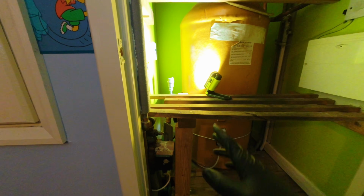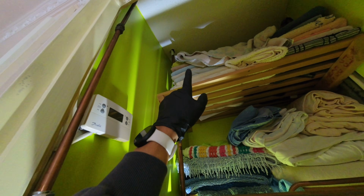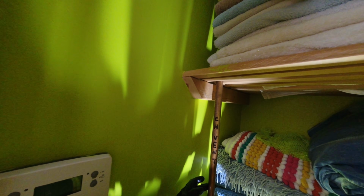Right, I've been up in the loft and I've bunged the F&E tank. I would have taken the camera up there, but it's quite tight up there where the F&E tank is. What's strange though, obviously the vent pipe here is 22, but where it goes up into the loft, it's reduced down to 15. But then there's also, hang on, this vent is in 15. Unless they've got the vents the wrong way around up there. Because that's the central heating vent.